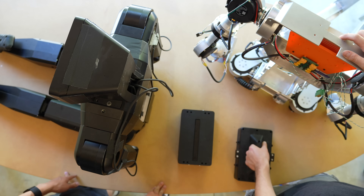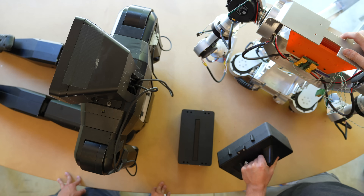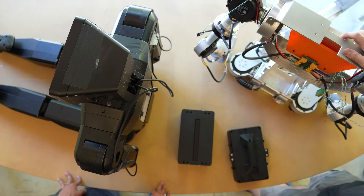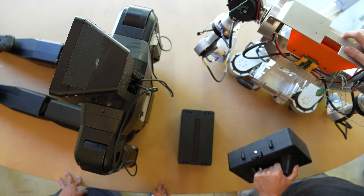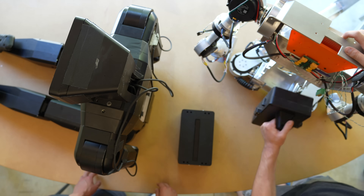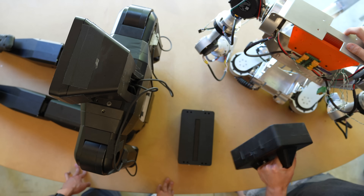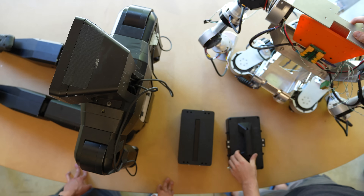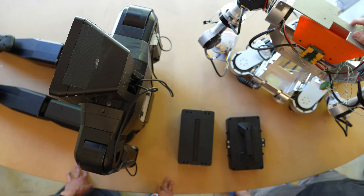Let's start with the battery — the heart of it all. Here we have our 13 amp hour lithium ion battery pack. Our first version had a nice solid handle with a ball detent locking mechanism on the side. We did see some initial issues with the ball detent not being super secure when the robot's running some of its more aggressive, high energy policies. Any sort of fall impact load cases, you're going to see this handle be the first point of contact.